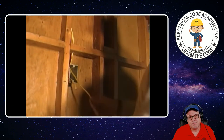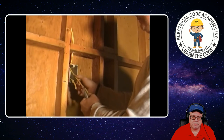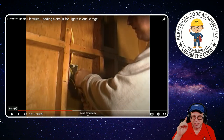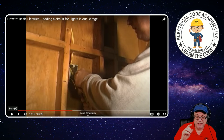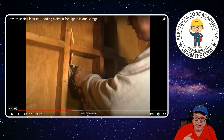We're back here at the box now. We want to go ahead and start making these connections. I'm going to take this razor blade knife here and go in about where my thumb is — leave like a few inches of the full insulation. Now, that's not insulation — that is sheathing. There's no rule that says you can't leave a couple inches in there, but you have to have at least a quarter of an inch enter into the box. It's probably excessive but not a violation — a little harder to work with the wire, but not a violation. What is a problem is I just don't like people going into boxes with razor knives because you don't want to nick the insulation on the conductors.